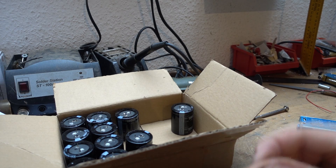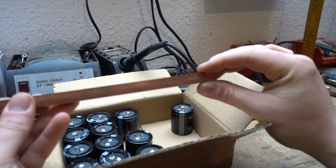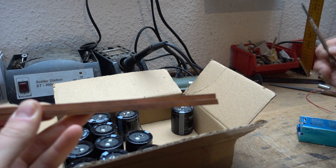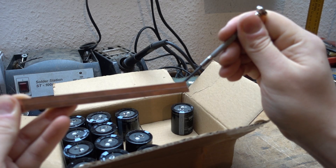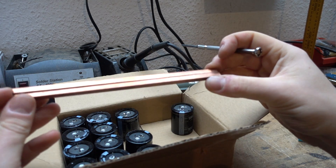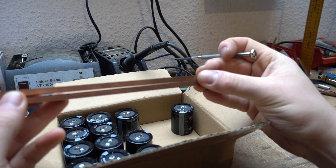Don't let anyone tell you different. We make a railgun, and the reason I chose lower voltage is that the longer the pulse, the better — because the projectile needs to be accelerated over the entire length of the rails. If you have 400V, the pulse will be over partway through. That's not what we want. We want a constant field over the entire length of our rails. So I thought we could try the safer, lower voltage.